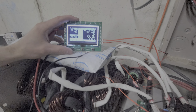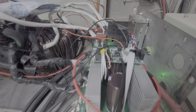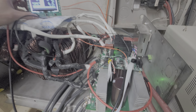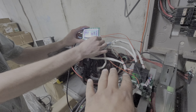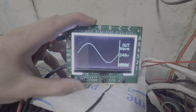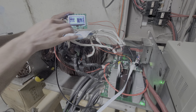There's not much on the screen, however our new main board is working perfectly fine in conjunction with the revision C control board. This is working great — this is our first power-on test, we haven't done any loads. We had to do a few modifications to get the LCD to read, but look at that — that's a perfect sine wave right there. Yes, it's idle, I get it, but still it's reading great.